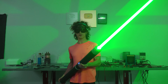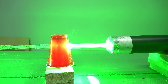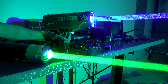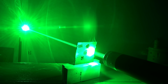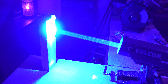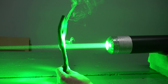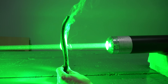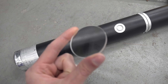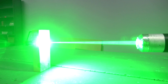If you're willing to call this thing a laser pointer, then it's by far the brightest one ever made — 6,000 times stronger than a normal laser pointer, and actually 60 times past the limit of the highest laser danger rating, which is class 4. That being said, this is not the most powerful portable laser I've built. At 30 watts of output power, it's actually less than a third of the output power of my 100-watt blue laser build. Even so, the green laser is substantially brighter — nearly 4 times brighter going off raw lumen output. This is due to the fact that the eye is much more sensitive to green than blue. Interestingly, both lasers use roughly the same amount of input power, which means the green laser is quite a bit less efficient. Green laser diodes and LEDs in general are not very efficient, and this is currently an unsolved problem in engineering called the green gap. Solving this problem will lead to more efficient lighting with better color rendering than current LED options. By sticking a lens on front, I can dramatically increase the power density at close range. Check out what it can do to a block of wood — the wood is shooting out a jet of fire where the beam hits it. Gotta love some good old-fashioned pyrolysis.